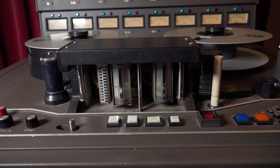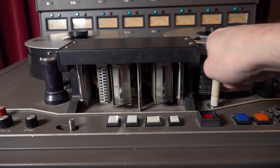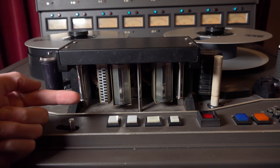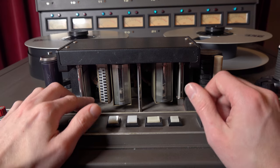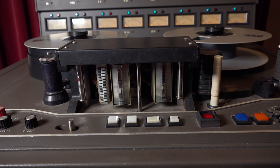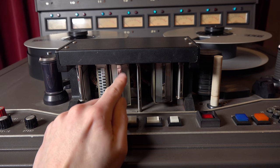Back in the day they almost never rewound tape — they always forward-wound it onto the take-up spool. That's called 'tails out' storage, and it results in less obvious print-through. Looking at the heads, there are three: the tape passes from left to right. The first head it encounters is the erase head, which clears the tape so it's ready for fresh recording with the next head.